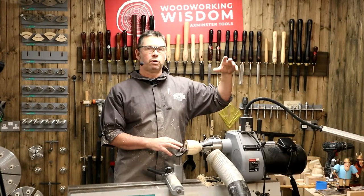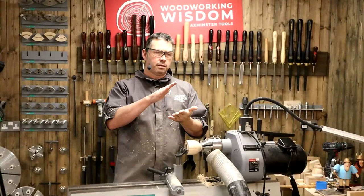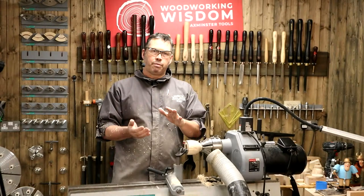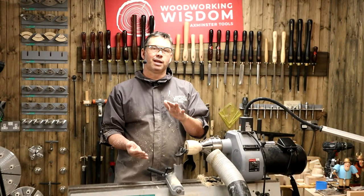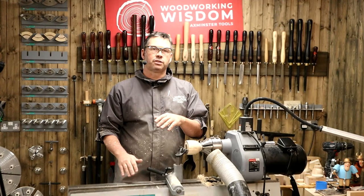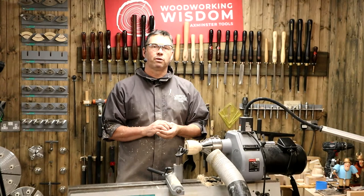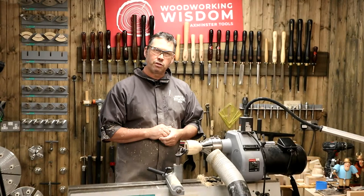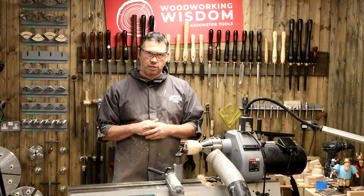A skew chisel, essentially, is you've got a rubbing bevel on the timber and raise the handle to get the cutting edge engaged. It doesn't matter what the bevel angle is, that happens regardless of the angle. So you raise the handle, you get a cut. You drop the handle, you get less of a cut. Your height differs, the lathe height differs, so that's going to present you at the lathe at a different position as well. There is a lot of talk about angles, and I get it on woodworking chisels and planes, things like that, but when it comes to a mechanical powered machine, I don't think it makes a huge difference, apart from what I just said in the previous question about sharper edges, that sort of stuff, and producing a different finish.